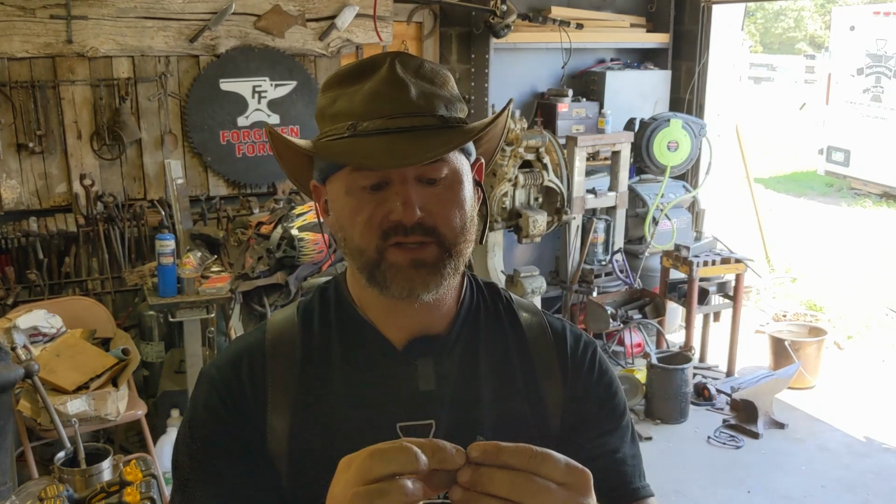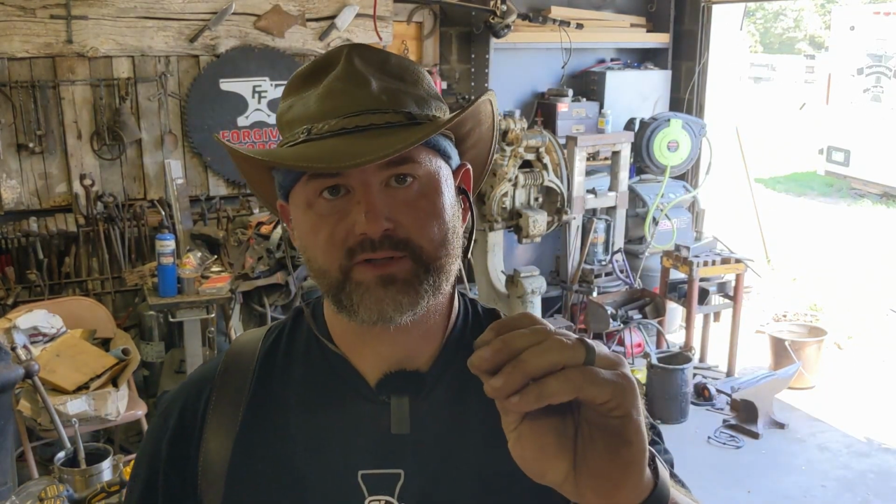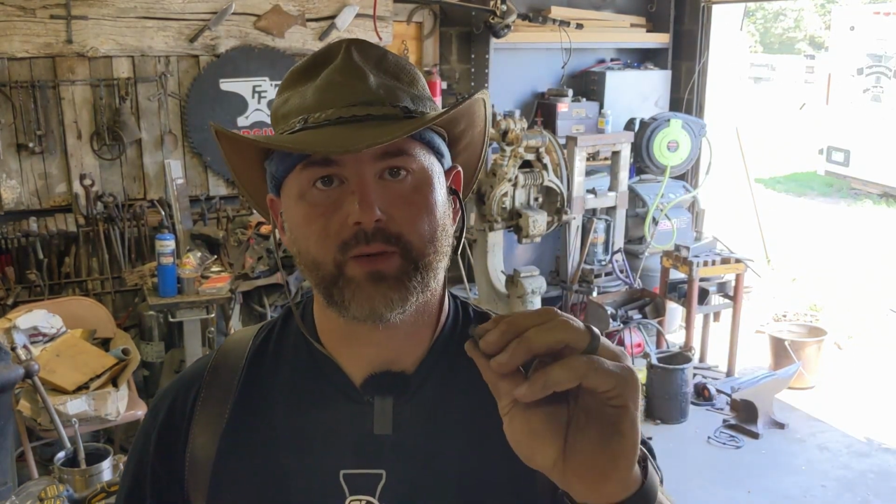But believe it or not, these little old nails, because they're square, they actually cut the fibers of the wood. A round nail made by a machine will actually separate the fibers, it'll rip it like that, and there's this little gap at the top and the bottom of the nail where it's not holding. But these square nails actually cut through the fibers, and they seat really well if you put them in right. And they hold more like a screw holds as far as strength goes.